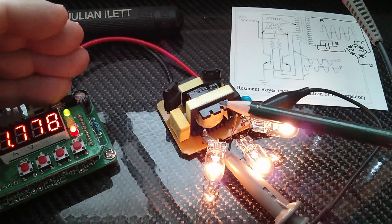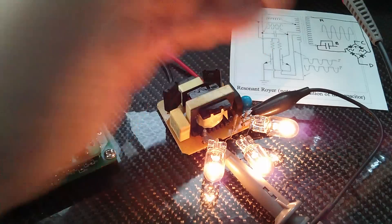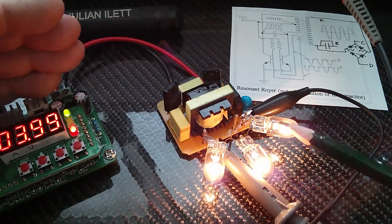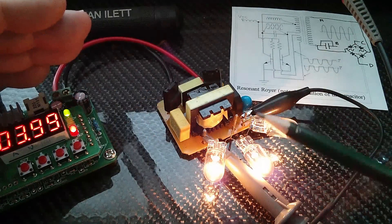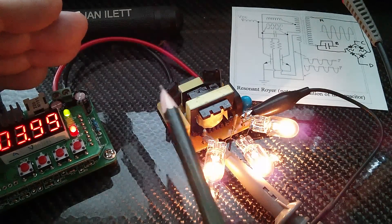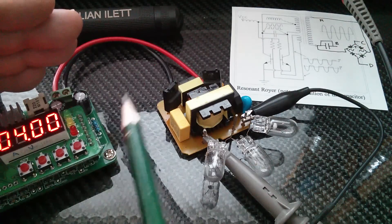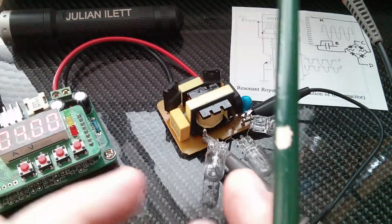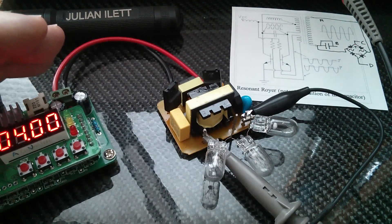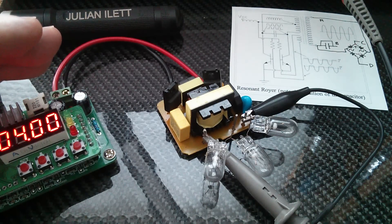It's cheap. It's very low tech. The frequency varies and it's not very power efficient because in linear mode this does get very, very hot. It will take in the low voltage I'm interested in — sort of between three and four volts — and put out about what I want to force into the entire pack. Of course this voltage will be pulled down by the pack, and there will be a DC current flowing through that bridge rectifier into my pack. That way I can distribute an excess of charge in one cell to all the cells in the pack. I'm going to attempt to attach these two wires to a cell in the pack and attach the DC output to the whole pack and transfer charge, watching what's going on on each of the cells with lots of DVMs. I'm liking this — far more than I'm liking this carbon fibre desktop surface. Cheerio.